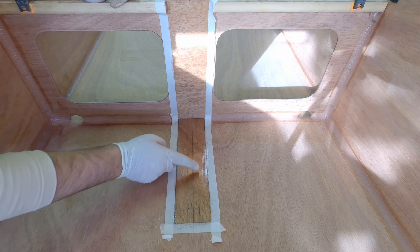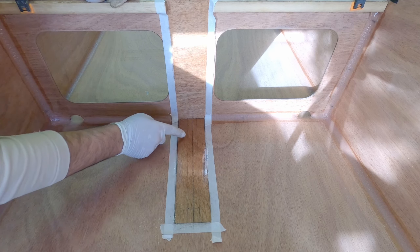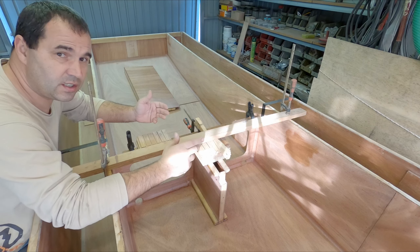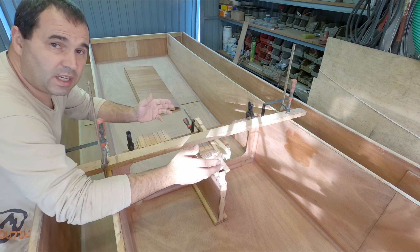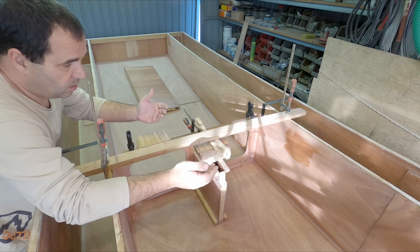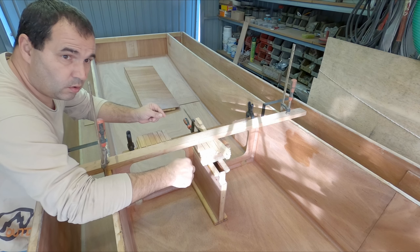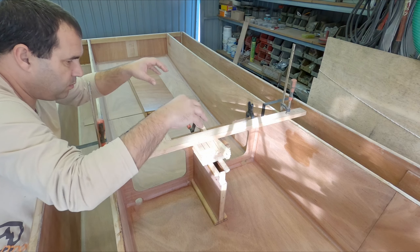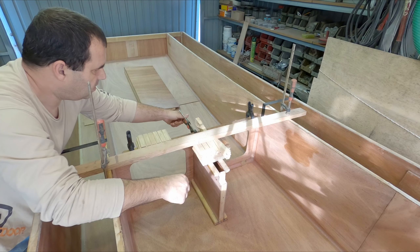Now the center case — I've marked the center case here on the bottom and drawn it out. I've put four small holes on each corner of the area I'll have to cut out, so this will be cut for the centerboard to go in. Those four holes will allow me, when I turn the boat upside down, to draw the same rectangle on the other face and just cut it out. I've also put a piece of wood here to make sure that when I put the center case it's not offset that way.